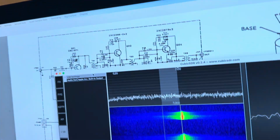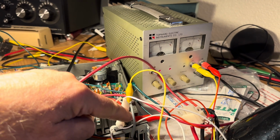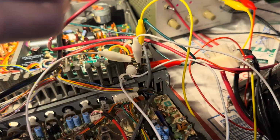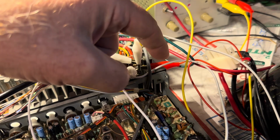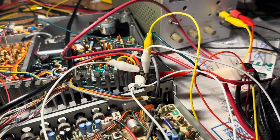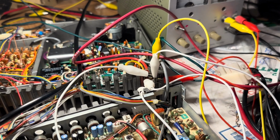So I guess I have a partial understanding of it now. And again, I have this wire powered, this wire powered, this wire powered. This wire is high current for the PA, and that's the horizontal pin here. These two are just simply attached here for power for TX and for power for that 7808 regulator. So that's as far as I've gotten.